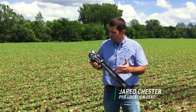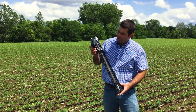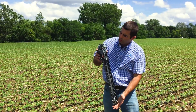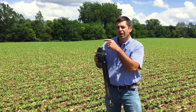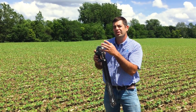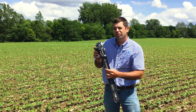To conduct these studies, we're using a new piece of equipment from Precision Planting called Speed Tube. This is it right here. It basically replaces your standard seed tube, so this sits in your row unit. Your meter sits up here, and basically these small fingers will grab that seed as it comes off the meter, and then it rides this rubber belt. It's an electric-driven piece of equipment, and that belt basically hand delivers it to the trench.